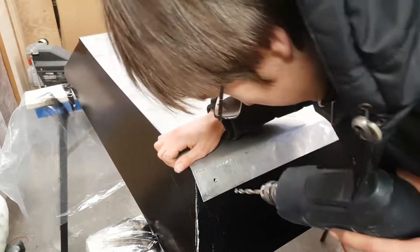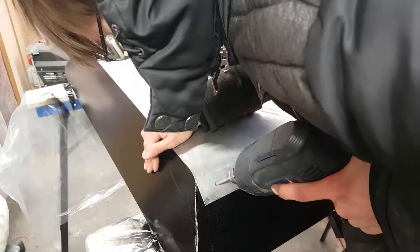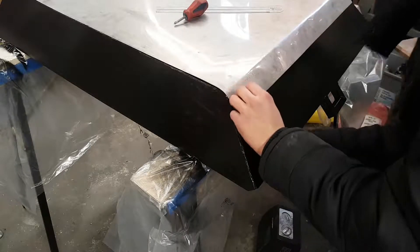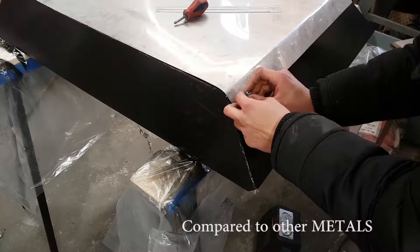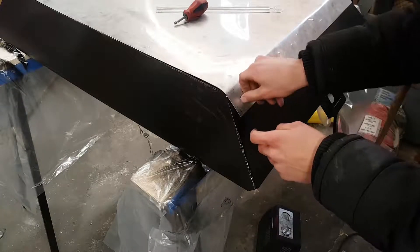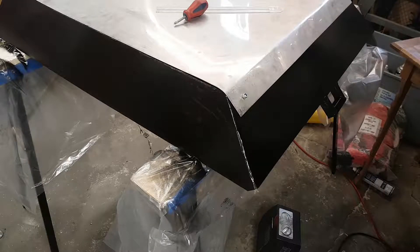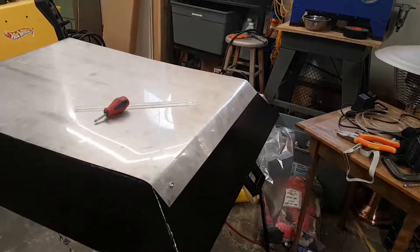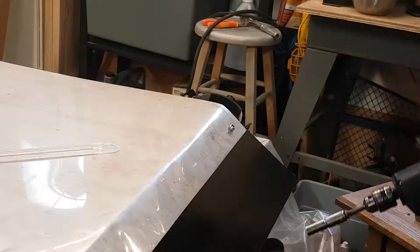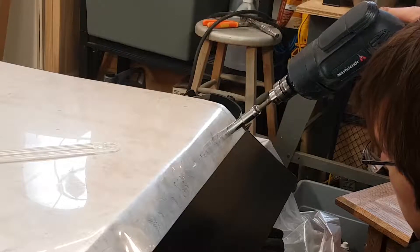The final part of any sled, and arguably the most important, would be the actual surface that touches the ground. For this I chose a flat stainless steel sheet, installed via simple bolts. I chose stainless because it is one of the harder metals, which should equate to a lower coefficient of friction, or lower drag. The stainless attribute is also helpful as it is exposed directly to the elements. Stainless might not have been the best choice, as a material like nylon — for instance, in a cutting board — would have lower friction and may last longer. The stainless worked perfectly fine on snow, however on concrete in certain situations it did not, which I will get to in a moment.